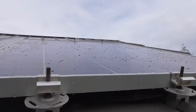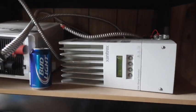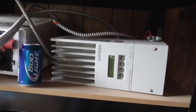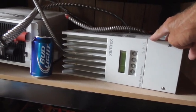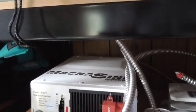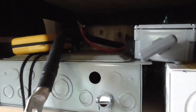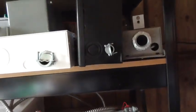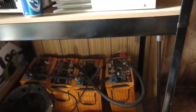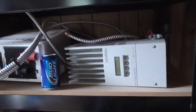We're in the little warehouse. This is what I'm using for a charge controller — a Xantrex MPPT6150, which is an excellent charge controller. The inverter I'm going to be using is a Magnum 4024. It's going to be a 24-volt off-grid system. I've got my auxiliary panel for power backup, a Midnight Solar combiner box, an additional transfer station for other things, and 400 amp-hours of battery storage. This is the system I'm installing.